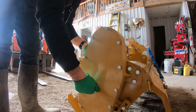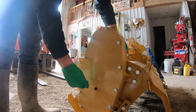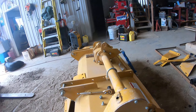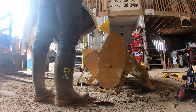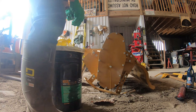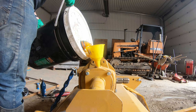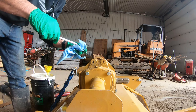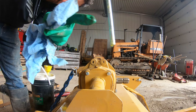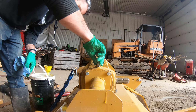I'm going to take this off and check if it has oil in it to begin with. I think this is where you check the level — and yeah, no oil. I'm going to top this up with oil. I'll fill it until it comes out there, then I'll check that one too. Even without screwing the cap on I can see I'm missing about three-quarters of an inch, which is about what the thread is, so by the time it screws in it should be right on the fill line.